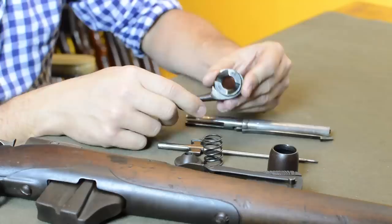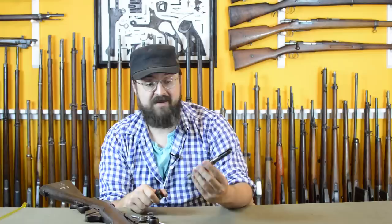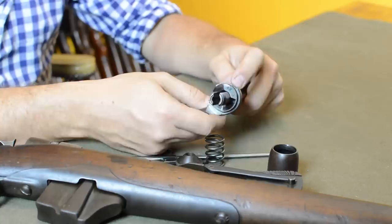So basically when this guy is home, the twisting force pulls him back and cocks the action. Awesome design for the time. The only problem is it's on this collar — and because it's on this collar it's actually a little weaker than it could be. If it had been put on the bolt body, well, this would be modern strength. Because while these are shallow lugs, they are very wide and have a taper to them — there's a lot of theoretical locking strength here. But it's on a collar, not the bolt itself, so there's ever so slightly a chance of lateral play, getting pounded on by the force of the shot, which means you get some nice cracking into this action if you don't have the ammo just right for it.